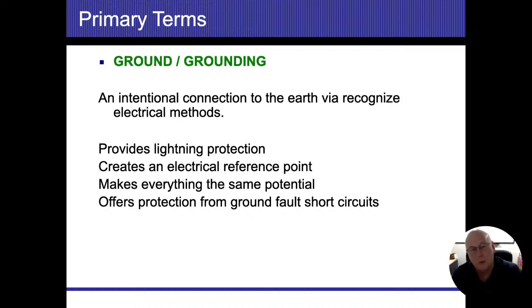So what I have to do is get that ground fault, because electricity is going into the earth when it's not supposed to. That's a ground fault. What I have to do is get that ground fault back onto the neutral, or the grounded conductor. If I can get it onto the neutral wire, now there's no resistance on that at all. Whatever electricity is available on the system will attempt to flow, far more than the 5 amps that the earth is going to allow.